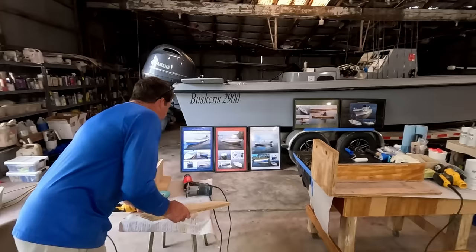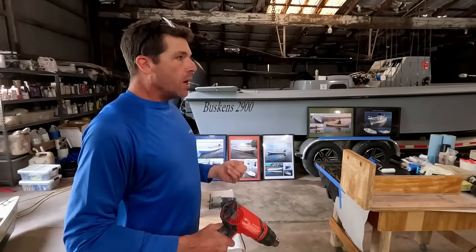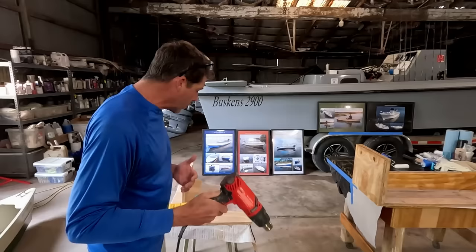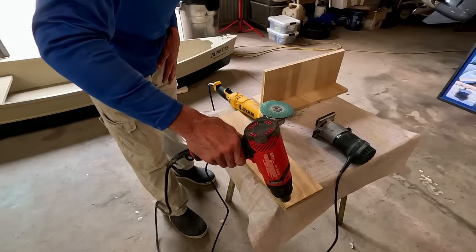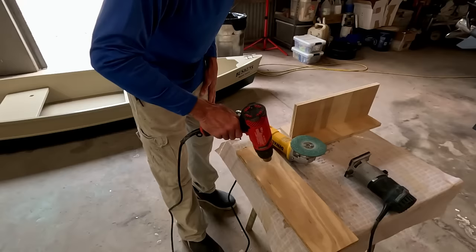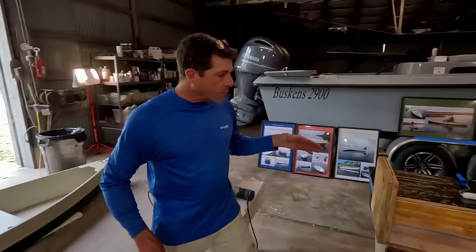You want to consider that plywood will soak up humidity or moisture in the air, so you want low humidity when you're going to epoxy over plywood. A mild temperature day with low humidity is going to be the ticket, but you can also help the plywood a little bit with some heat. We're using a heat gun — essentially an industrial hairdryer — to warm up the surface prior to glassing. Keep it moving, as it is very hot. The warm surface will cook any moisture off.